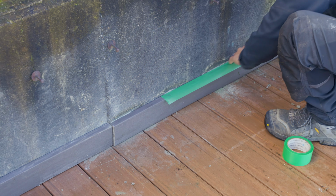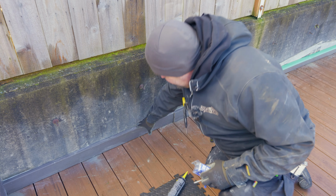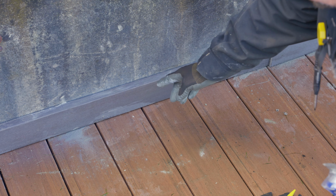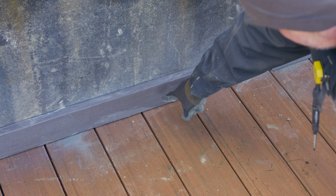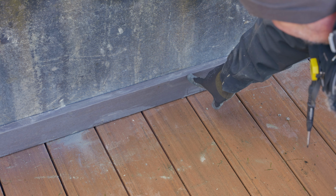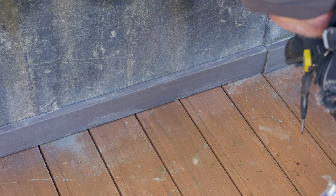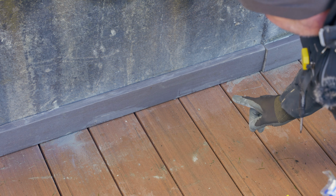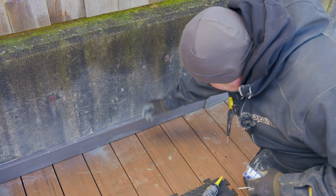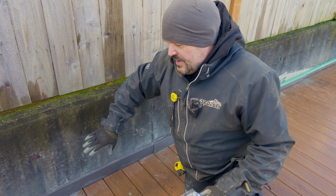Now as a visual, we have a piece of flashing behind this. So this piece right here is grooved out. I've dadoed out from an inch down, it's dadoed out a quarter inch. So the top of this board is tight up against the concrete, but the bottom of this board has a gap. So I filled that full of sealant so that when we screwed this to the wall, it squeezed up against the flashing because the flashing stuck out from the wall a little bit in certain spots. Now it's all glued together, and so the top and the bottom are sealed.